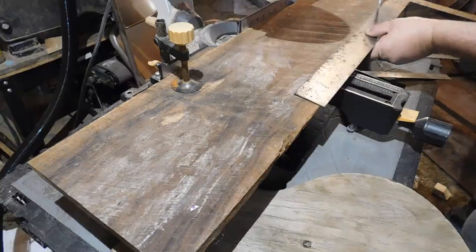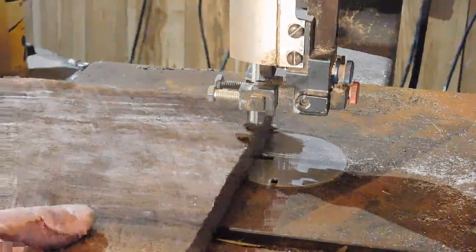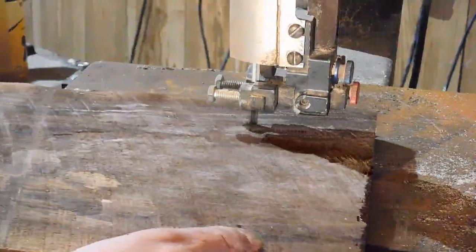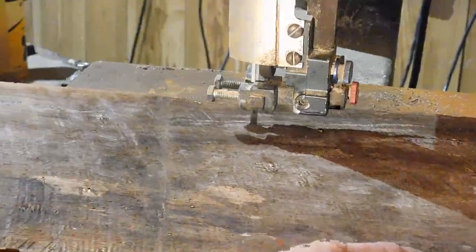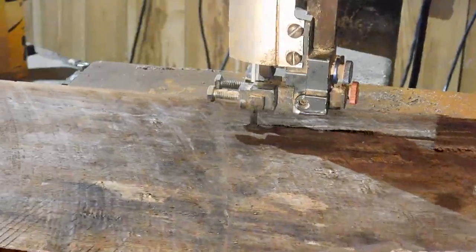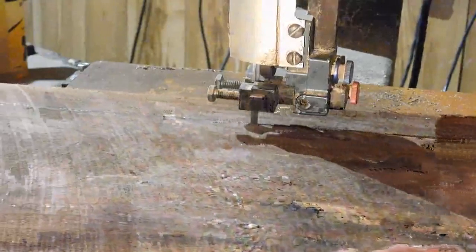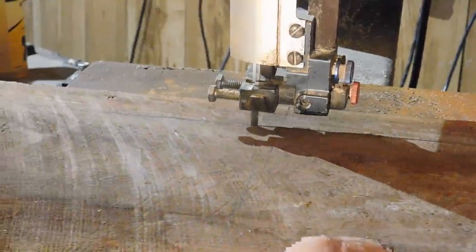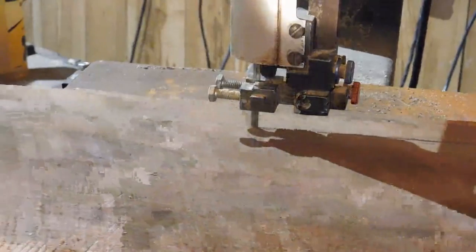Here I'm cutting one of the edges down and getting it sized properly. The reason I cut that particular edge off was it had a little bit more of the white-colored sapwood that walnut has, and it's the rough edge closer to where the bark is. So I just wanted to get rid of that edge and have a nice clean edge to work with. This is going to be a four-piece sandwiched or pancake blank. I like doing it that way, and you'll see a little bit later on why I chose to do it that way on this guitar.